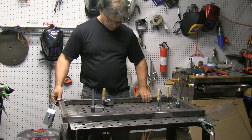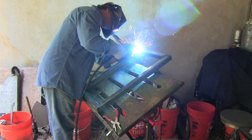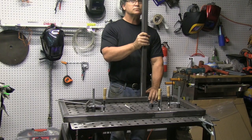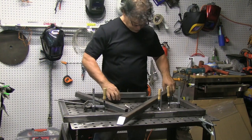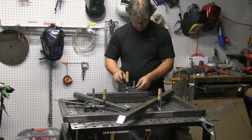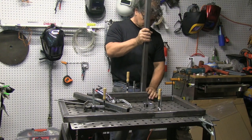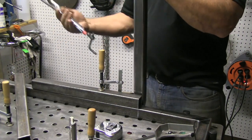What I'm looking at here is the 18 by 36 bottom piece, and these are the 18 by 26 shelves — these were MIG welded and the bottom was TIG welded just for kicks. Now these riser pieces are 38 inches long, and because they're tapered on the ends I can't just clamp to the outside of the bottom piece, so I'm going to clamp a piece of scrap tubing to the top and clamp down to that.